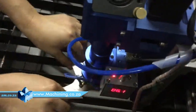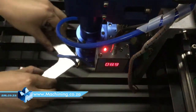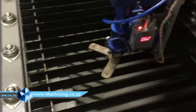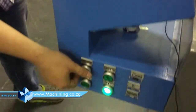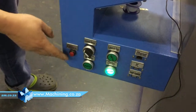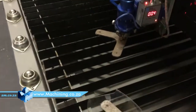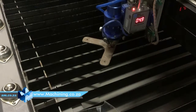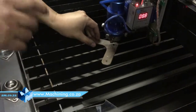Basically like that, then this setting is done. How do we test it? We can put the four perspex pieces here, and then looking from the side, we adjust to auto focus. We just press the auto focus button and the head will go down by itself, eventually reach very low, then come back up. Then you can put in metal and start to cut.